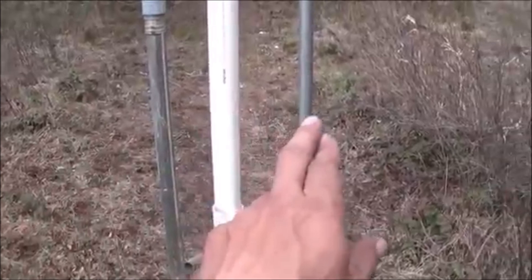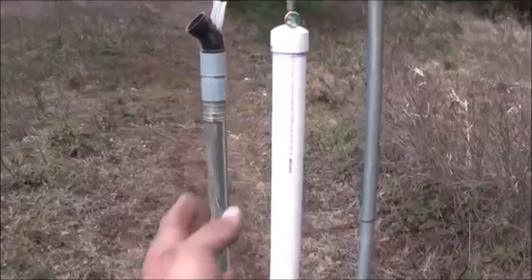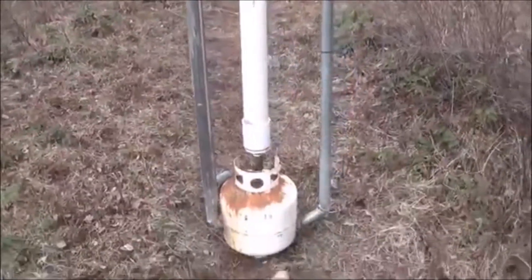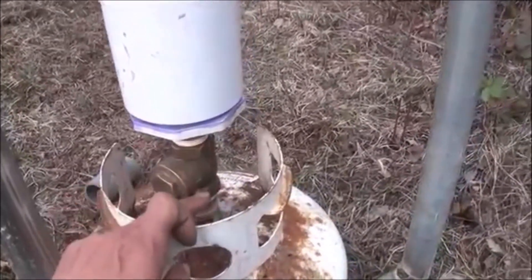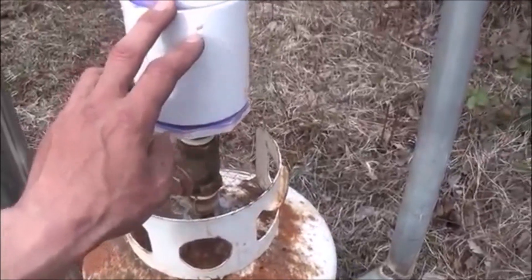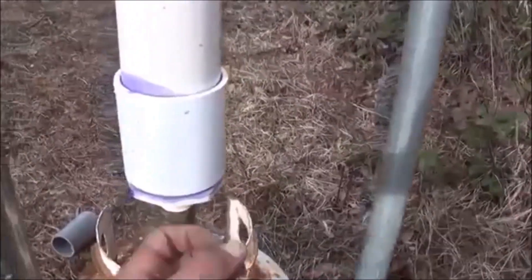If you notice, I've got a larger pipe in than I have out. This will allow for a large volume coming in from uphill — it'll grab a lot of air. I didn't want to grab the air too far uphill because the water ram effect is going to stop that flow and probably let those air bubbles travel back up the stream if the air is being inputted too far up the pipe. This seems to be about the perfect length to allow the water flow to generate and start pulling air into the system, get the air down to the tank, and then the valve slams shut up here, jacking that air up into our upper cylinder. Once the upper cylinder is full of air and the pressure is greater in the cylinder, this one-way valve will go closed, capturing that air up in here and making sure that nothing from down here at a lower pressure can get back out of this upper tank once the water ram effect takes place, locking it into place.